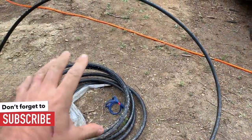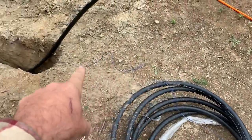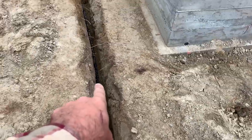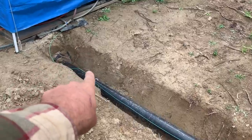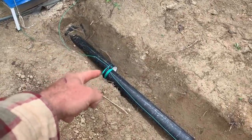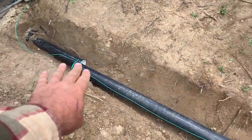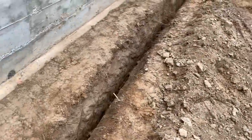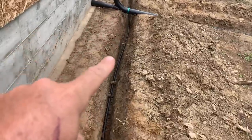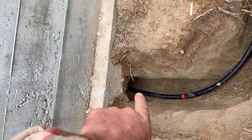Let me show you what we've got right here. We've got inch-and-a-quarter poly with a blue tracer wire right down in this trench. The trench is about two feet deep but we're going to backfill from here out and then slope it down, so the pipe is actually going to be almost five feet underground here. We've got our sewer line here — we actually had to cut it and cap it for the inspection — and it comes up to a clean-out and then goes into the house. The poly line runs underneath the sewer line and then goes underneath the footer for the house. There is a lot of rebar in that foundation — we put in way extra rebar — so digging under that little spot was not a big deal.